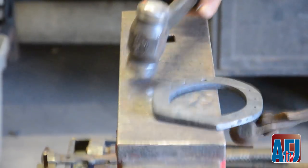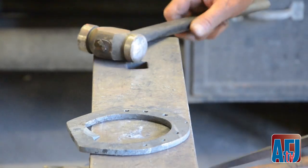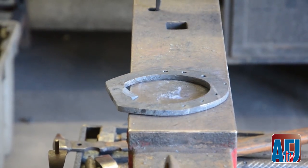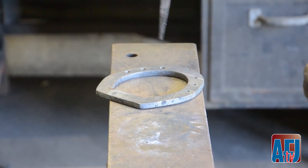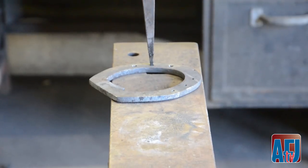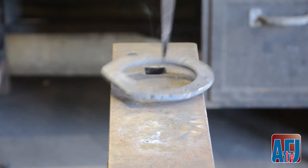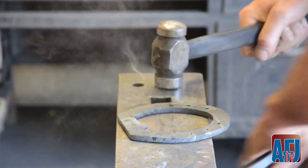If you look on the back side, I've got a nice flat spot where I bottomed out my punch. When punching nail holes, I want to be as close to two edges of the hardy hole, or as close to the edge of the pritchell hole. So when I'm punching the nail hole, I'm trying to be as close to both sides of the hardy hole to get more shearing effect. If I punch my nail hole right in the center, it's just going to belly out everything and give away the resistance. I come right here, get close to both edges, and I get more shearing effect - more of a rectangle hole on the other side.